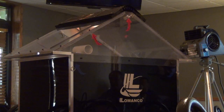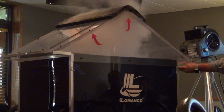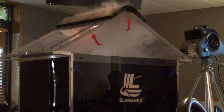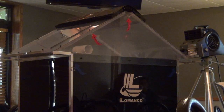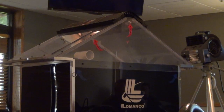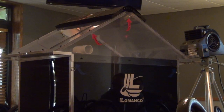With soffits open, soffits and ridge vents — that's the best combination. The NFA per foot on the ridge vent is 72 square inches per piece. Before I started, 750s were our best seller. Now this is our best seller. Everybody likes ridge vent.